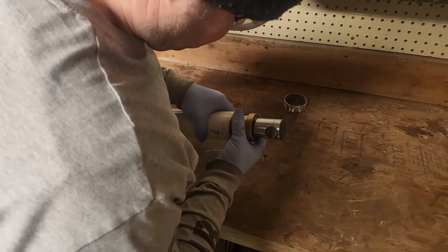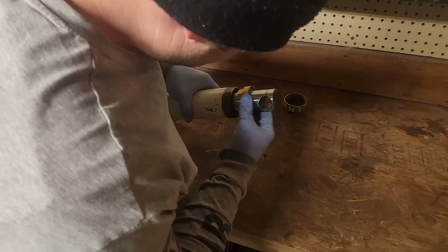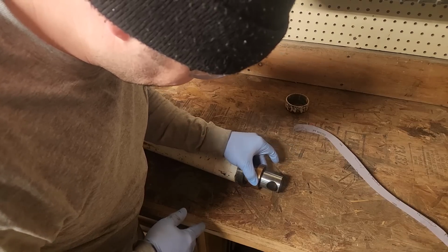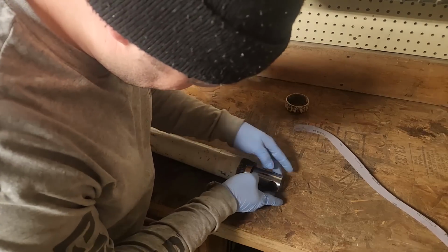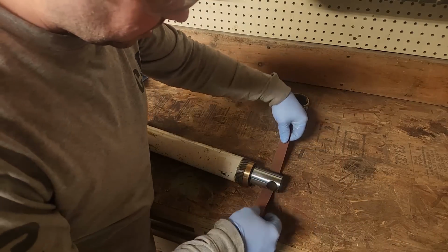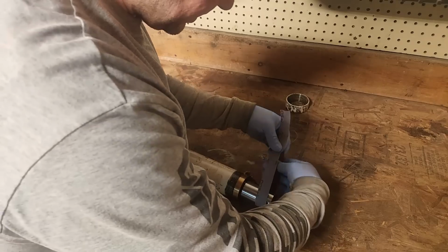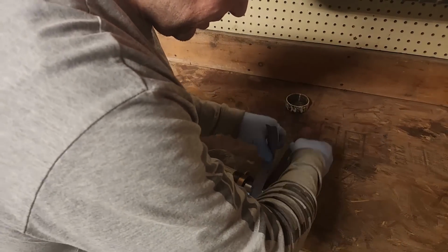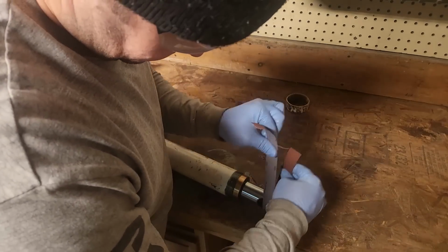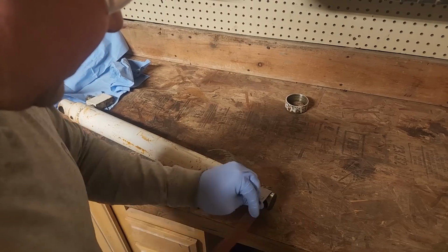So the lip seal is part of this brass sleeve, it would appear. So that guy's having a hard time sliding over this area here. It would appear someone's ground this before. I wonder if we've probably got a high spot, so I got some sandpaper. And we're just gonna see if there's any high spots. This is not where the seal even sits, so I'm not that concerned. This is just where the pin goes. But we'll give her a little polishing here. It's probably a high spot.